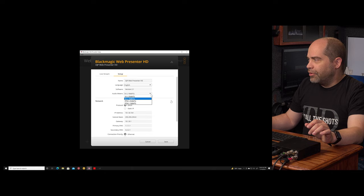Then we have the SMPTE 292 CRC. This is basically a CRC error detection algorithm — if there are problems in the incoming data stream where data is being corrupted in transit, this would let you know there's a problem. In this case the data check is matching what it's expected to be, so it's showing OK. If you were to see anything else there, that's a strong indicator you've got a problem with a cable somewhere — you're dropping or flipping bits. Investigate your cable, check for kinks or loose connections, and make sure the cable is capable of carrying the bandwidth.